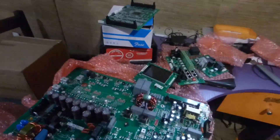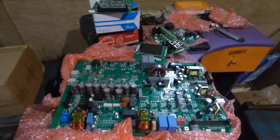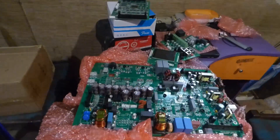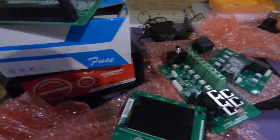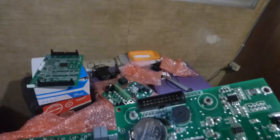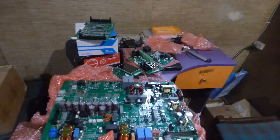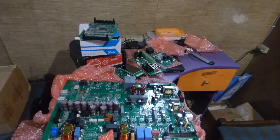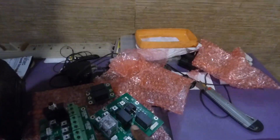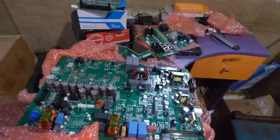Now you see components here — six components. If you recall, I had a 5 kilowatt inverter that failed. Deye has sent me a replacement of every component in that inverter: a new display, a new motherboard, communications board, the screen, the SPD, and another protection board. I have to put this back together and hopefully I'll get it right. There's also a small battery for the clock on it. I don't know how I feel about this, but at least they've made good on the warranty — they're replacing every component instead of just the specific part that blew up. It looks daunting and challenging, but I think I'm up to the task.